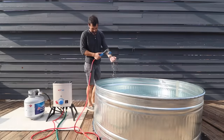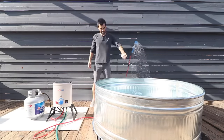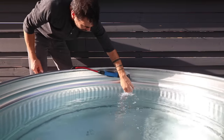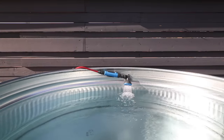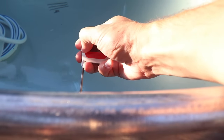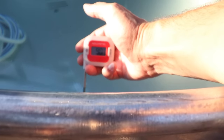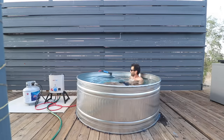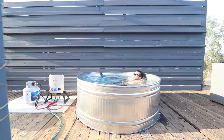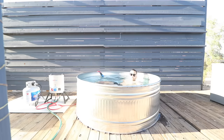This system is most well suited to make an outdoor shower and by itself doesn't recirculate water, so I can only add hot water as I fill the tub. But if I wanted to make it even warmer I'd have to drain some water and add more hot water. The water was coming out of the Hot Tap at about 108 degrees and after filling the tank the rest of the way that water was right around 90 degrees. Now this was perfect for this particular day since it's 100 degrees outside, but in order to actually turn this into a real hot tub we're going to need a way to recirculate water from the tub back through the heater.